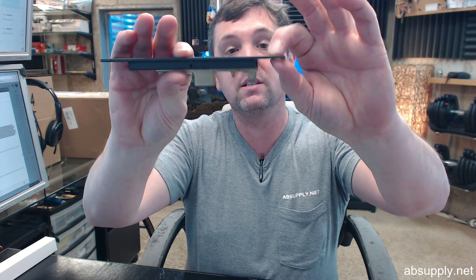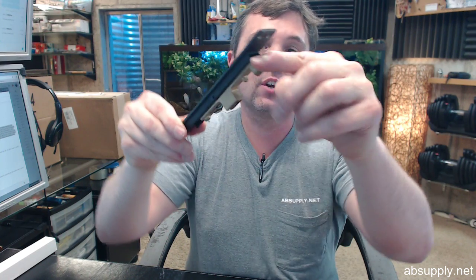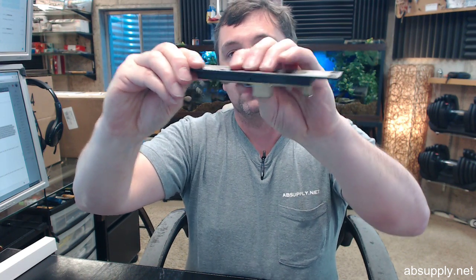But a wood door is a different animal, meaning you're going to do two preps with your router. The face plate will be one prep, but then the body down here will be another prep. So you're going to have to prep for the body, and then come back and prep that 1 by 6 3/4. That's easy. You can do that. The trick is drilling a hole from the top or bottom of the door. That's 1/2 inch. That's straight.